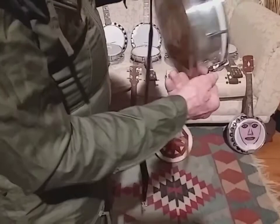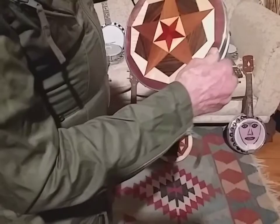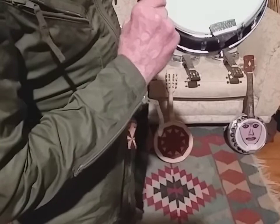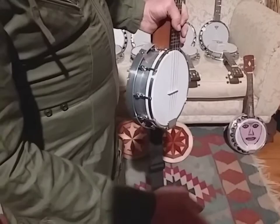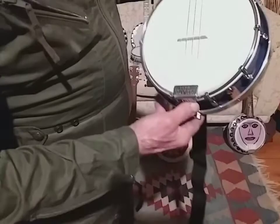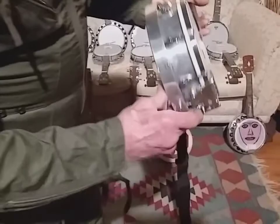As you can see this one is not a saucepan — this is a part of a pressure cooker that I've fixed round there. By the way, these rims are stainless steel. What I've done is I've got a sheet of two mil stainless, put a straight edge on it, cut these strips, then bent them round something and then they've been welded underneath so you can't see. These are more or less cost nothing. We can talk about all this later on when I take one of them to pieces.